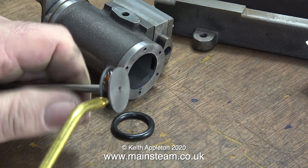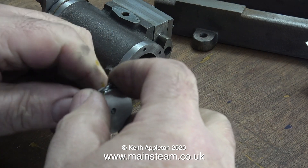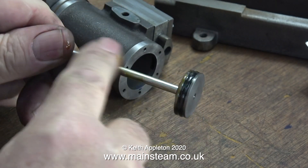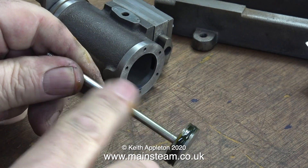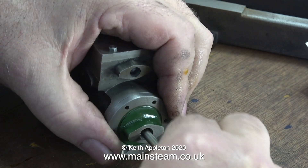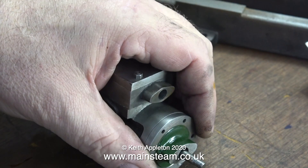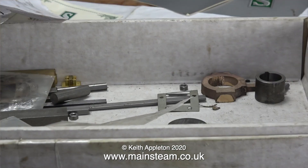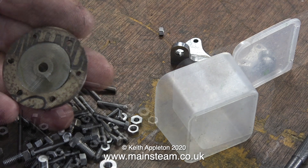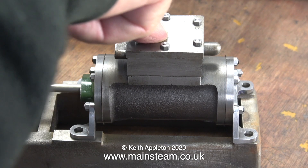Now it's time to see if the piston I've made, complete with the ring, fits in the cylinder. I'm using plenty of steam oil as part of the assembly — as you can see it's going everywhere. Here I'm spreading some of the steam oil on the piston rod too. With the piston and rod in position and the cylinder cover held firmly in place, the piston goes in and out just as I would expect it to, and even if I rotate the piston rod it's perfectly concentric with the cylinder. For the acid test, I'm fitting the gasket and bolting the rear cylinder cover in position — the piston and piston rod are a really good fit in the cylinder.